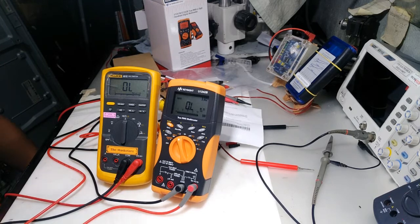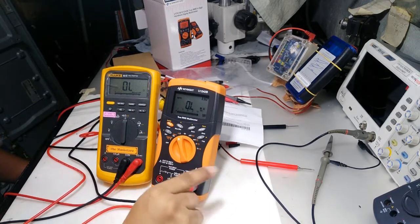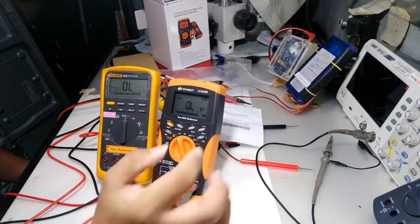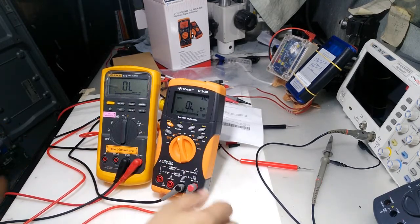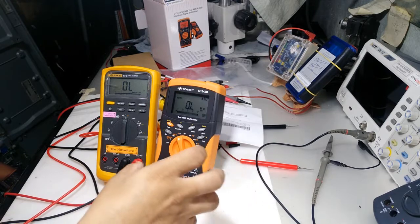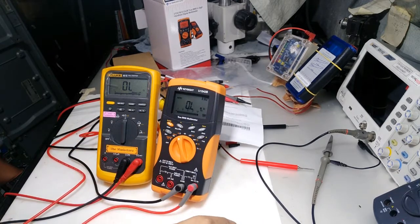Okay, now next, I guess you know how to use the microamperes. Your tester must be in series in the circuit you made, whatever circuit you are up to, so you can measure the power consumption of the circuit.